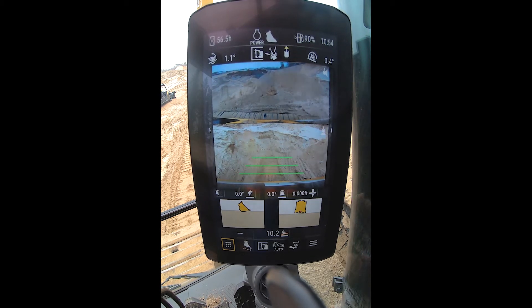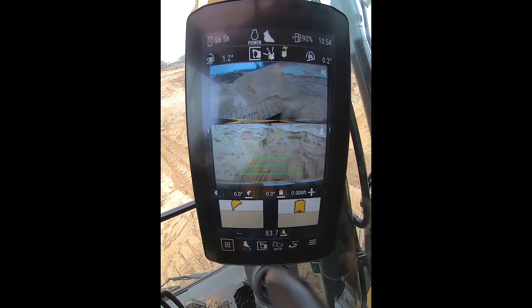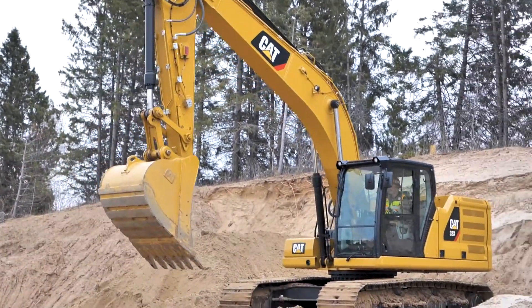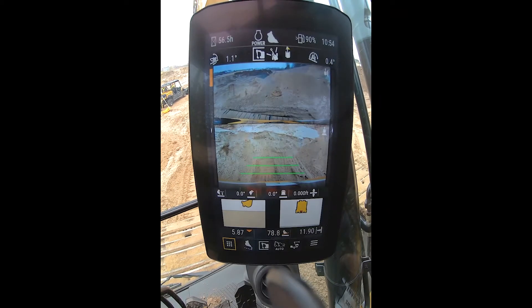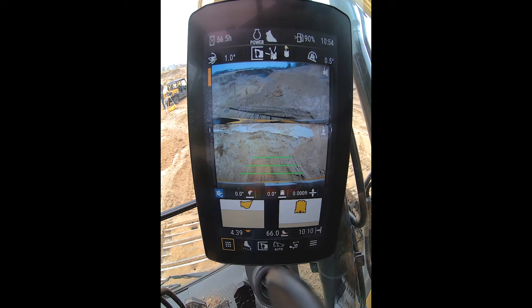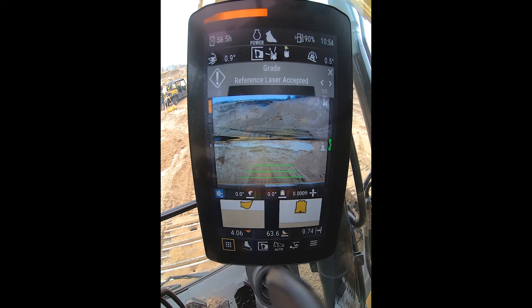So we can do a traditional benchmark. What we can do is reach over, and from a known elevation, we can set a benchmark — whether it's grade or if we have to put a cut or a fill in from that spot — it doesn't really matter for what we're up to here. We're going to go ahead and put a mark there. So that's our grade. Now we're going to bring the boom and manipulate the stick to where we can get the laser into the catcher. And you can see on the right-hand side of the monitor there — I'll bring it up again so you can see it — you're going to get the icon there. I'm going to hit the button. Grade has been accepted.